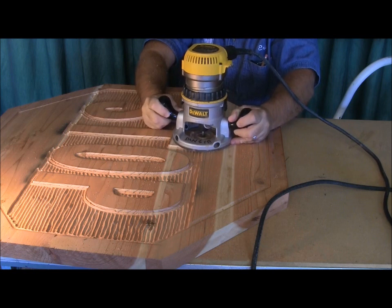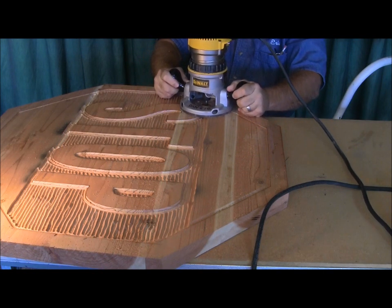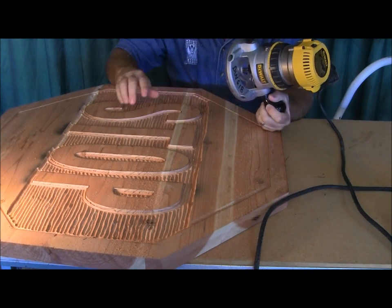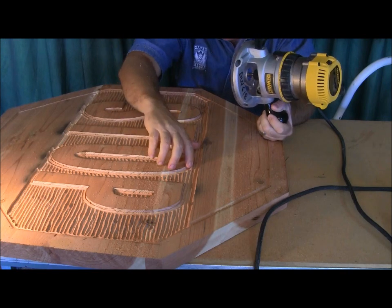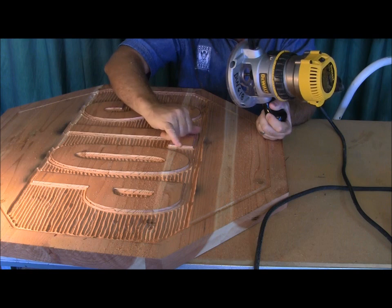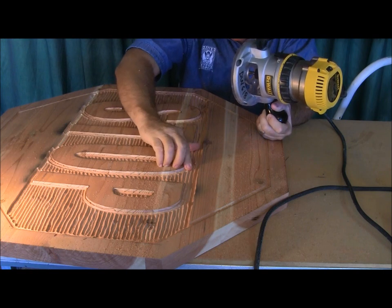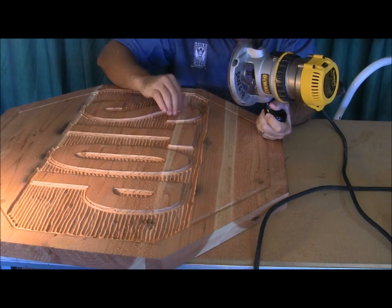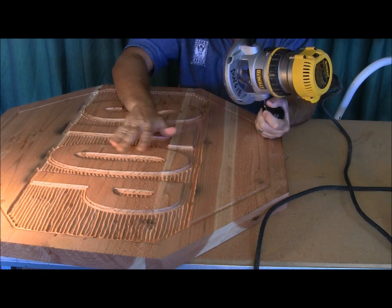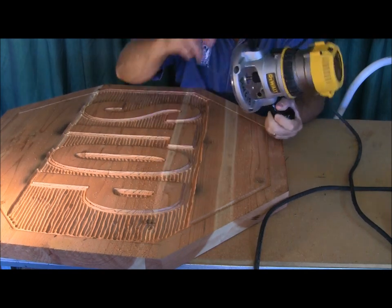Long run. So whenever I have high spots, I don't know if you can see this, Dad, a little high spot here and here. Are you in on that? Yeah. Okay. On those, they're thin enough, you just knock them down. If they're thicker, you definitely want those down so that doesn't come up a white spot when you're doing the sanding.